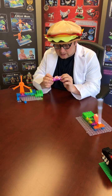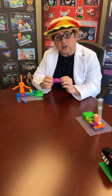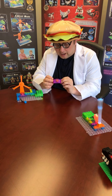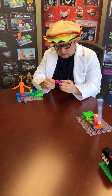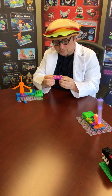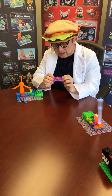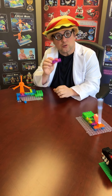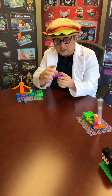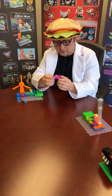Now if you see this part number 84, it actually has 4 connection points. But the markings on it, you can see there's a little squiggly mark. That's the inductor. That's just connected to these two. And then there's a marking on it that looks like the same marking as on your reed switch, and that's connected to these two. So there's actually 2 things in this device: an inductor, which you see here, but also a reed switch is in there.